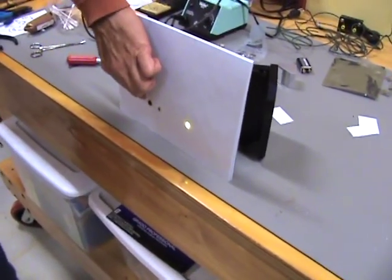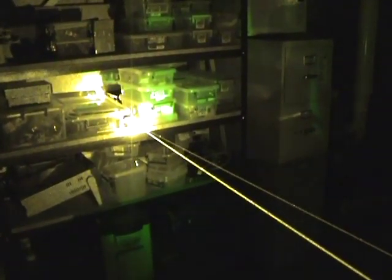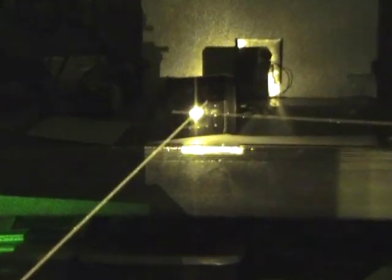In order to show how bright the laser is, I'm going to take the attenuator away. There's a mirror I set up beforehand that aims the beam outside of this building, to give you an idea of just how powerful this laser is. The beam is now reflecting off that primary mirror, back across the room about 11 meters away, and then it's being sent to a tree about 20 meters behind the building. It's a very bright lemon yellow. I'm not sure if it shows up very well in the camera — sometimes video cameras have trouble in dark conditions. But you can see that even the trees around the beam are illuminated, and this is at 50% power.